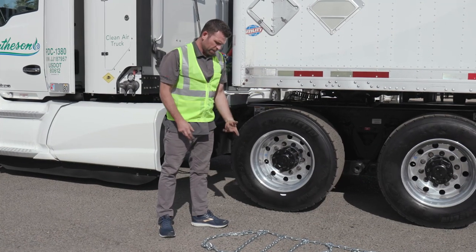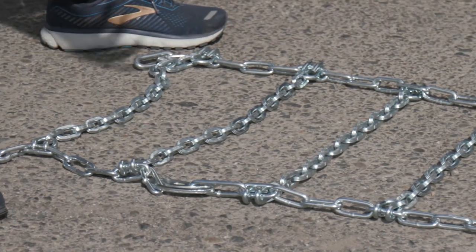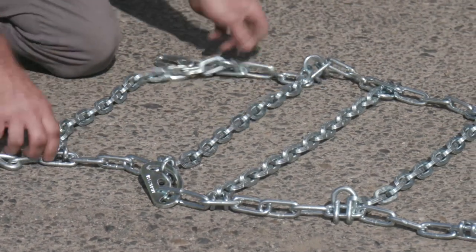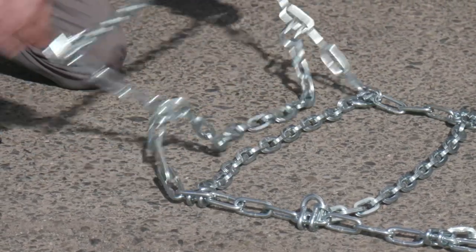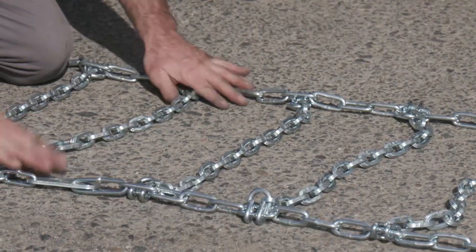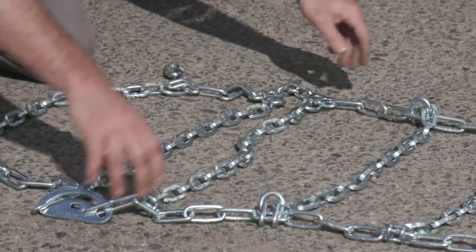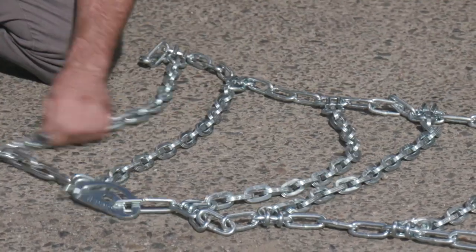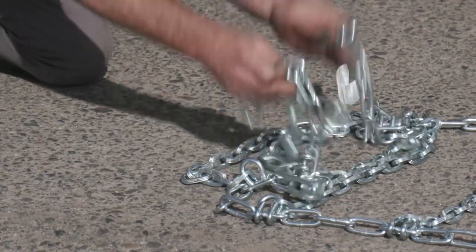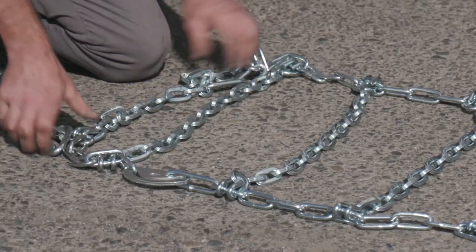The last key step is to make sure there are no twists or kinks in the chain. Although you may be able to get it to fit with twists, you've created weak points, and those are going to be the first places to break. Make sure you inspect these twists and start to take this puzzle apart — unwrap and unwind — making sure that all of the side chain and cross chain lays down flat. This can be time consuming but is well worth it, working cross link by cross link to get those twists out.